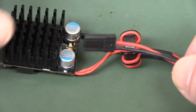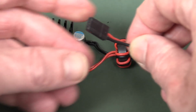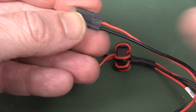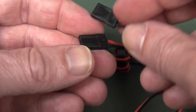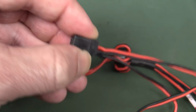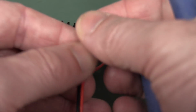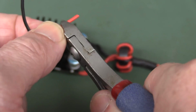Okay, so it may do the business, but we've got these tiny little piddly connectors which aren't going to do the current. You can, of course, put them in parallel like that, but, 15 amps, these are going to get maybe 5 amps each, so, like tops. So, really, you can't do the maximum 15 amps with just these two. Anyway, let's cut these off and have a look at the wiring inside here to see if it's adequate.